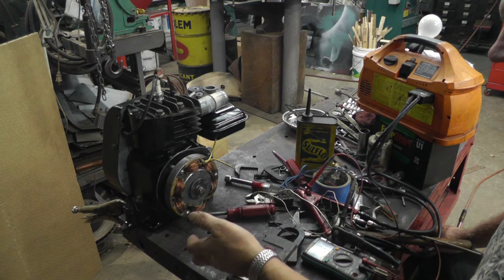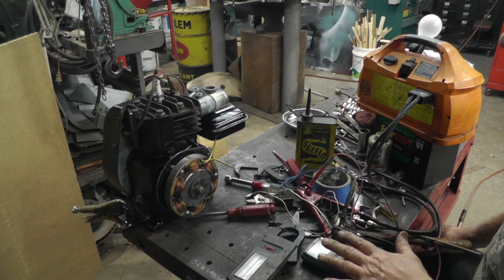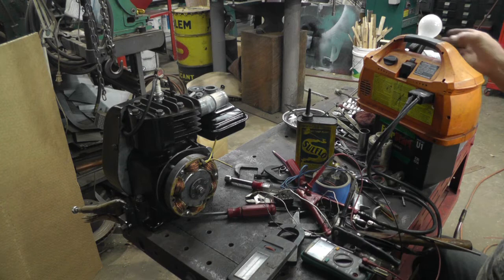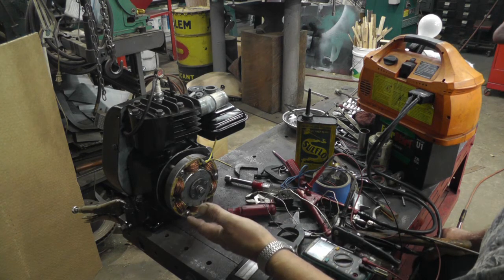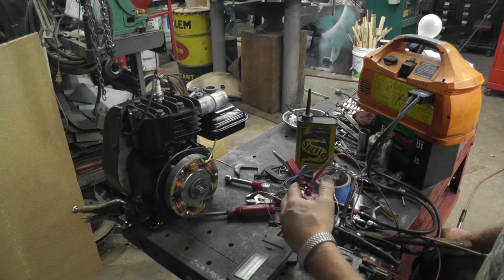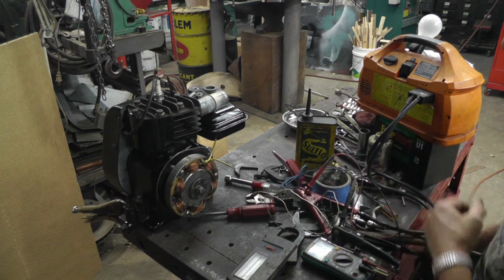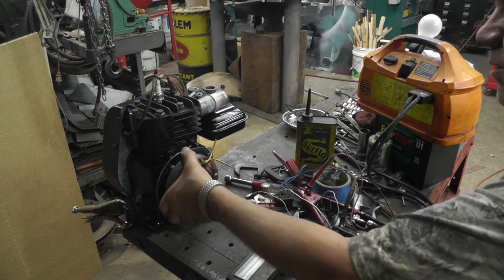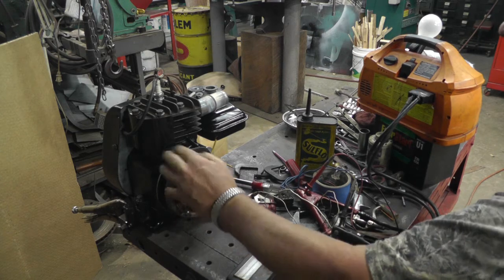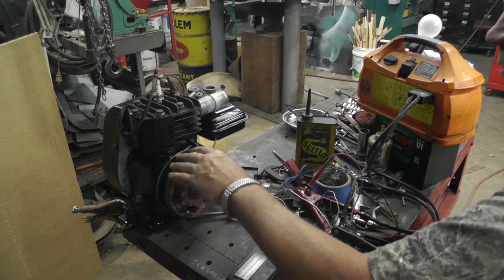And 4.5 amps will keep the battery at about 12.2 volts with that 60 watt bulb running. So I guess with all these inefficiencies, it'll make 60 watts. This doesn't hardly even get warm. And the coils don't even feel as warm as the iron.